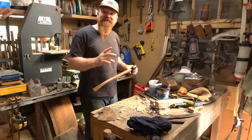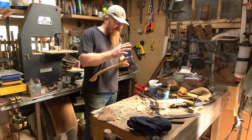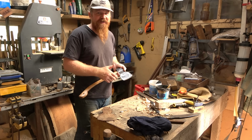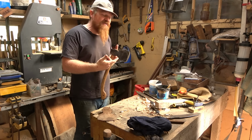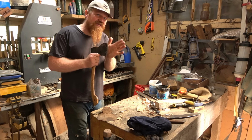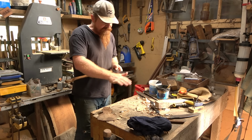Actually, that brings me to something I was going to mention, and here's my tip for the day. If you have a broken handle in an axe, don't just chuck the axe in a bonfire or on a barbecue or anything like that to burn out the handle, because all that heat treating you've seen me do here, that will undo it. And then you'll be able to get an edge on your axe, but it won't be able to keep it because it'll have lost its hardness.